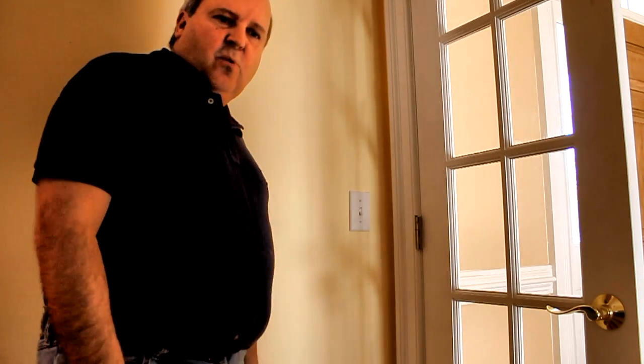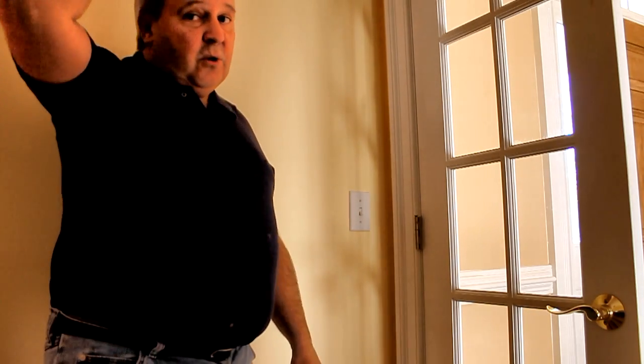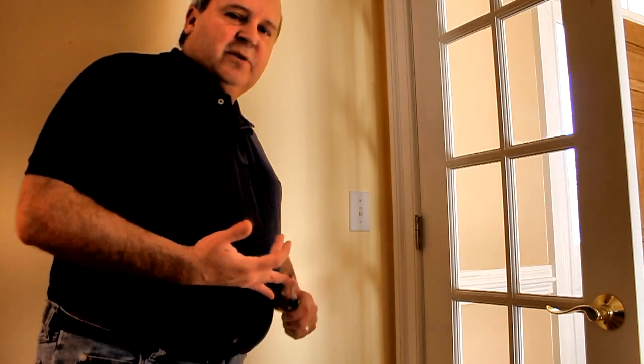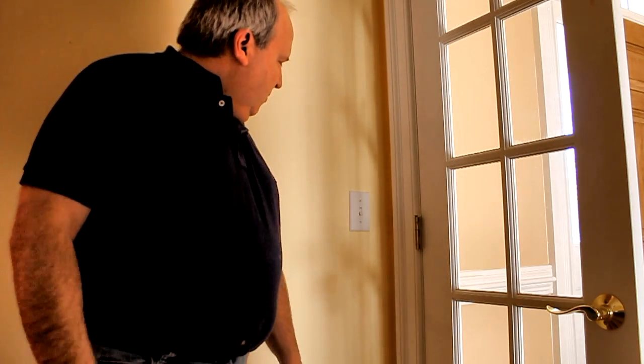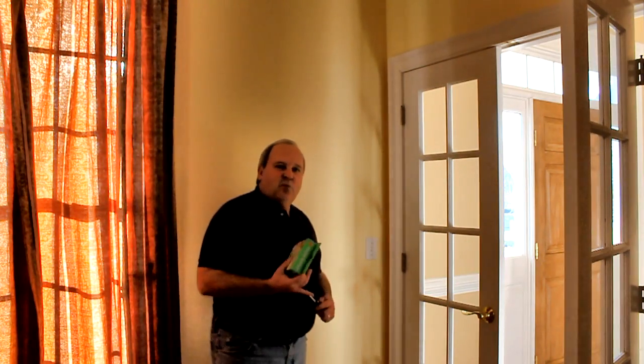So all you have to do now is go around and look at all your exterior walls, count up the number of outlets you have, the number of switch plates you have, and so forth. Go to your local home center or order them online or other locations like we talked about. We've insulated one outlet and one switch cover. As you can see, super simple to do, very inexpensive, and if you can operate a screwdriver, you can cut back on all these leaks within your home.